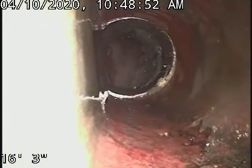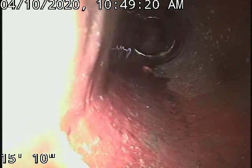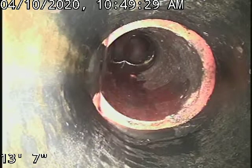Set here. And the toilet does run down that, so that could pose an issue. It's like concrete or something at that joint, because the joint looks fairly straight. See how it kind of pools water there too. And then on to ABS piping there.